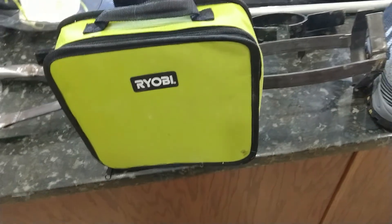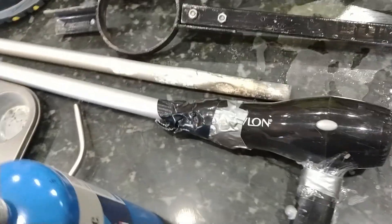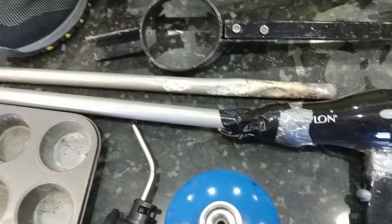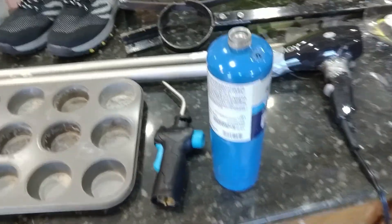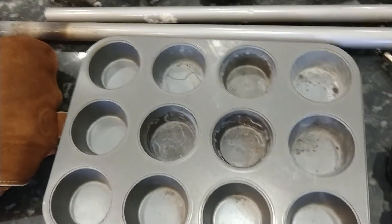We're going to need a drill for creating the air holes for the casting. We're going to need some safety equipment: a face shield, a face mask, some gloves, and an apron. We're going to need a blow dryer duct-taped to a long tube — I used a regular curtain rod. And a second tube for mixing the metal. Also a furnace lighter or something to light the carbon with.